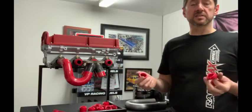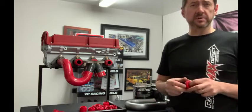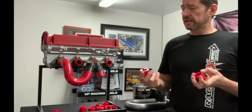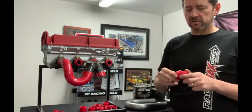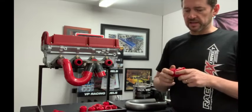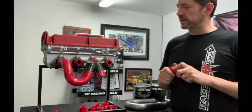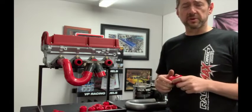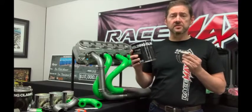There are also header kits available for turbo headers, coming in two sizes: 1250NP and 1500NP, where NP stands for nominal pipe. The same principle applies — it comes with a series of straight and angled blocks that snap together, so you can play with the design, get it right, then transfer that onto the actual pipe and manufacture your turbo headers a lot faster and easier.